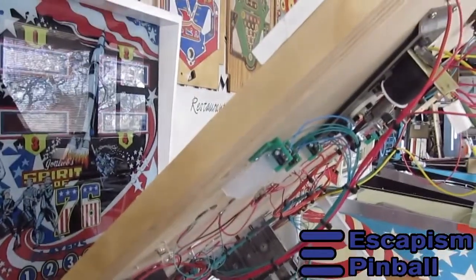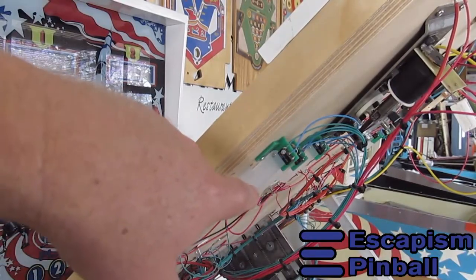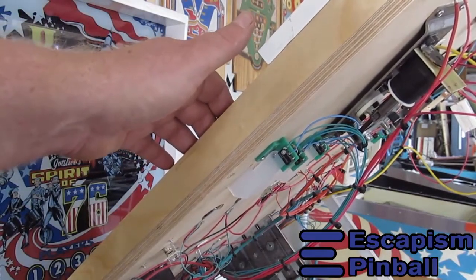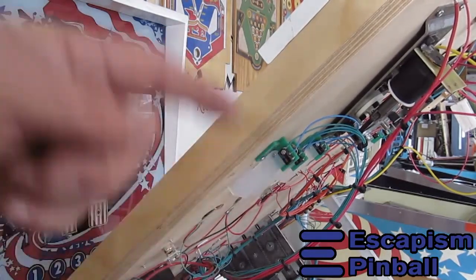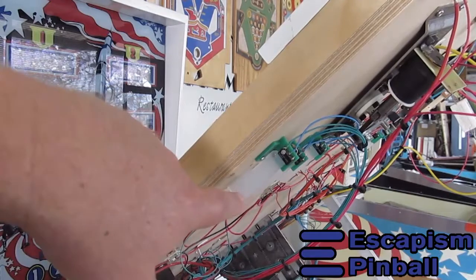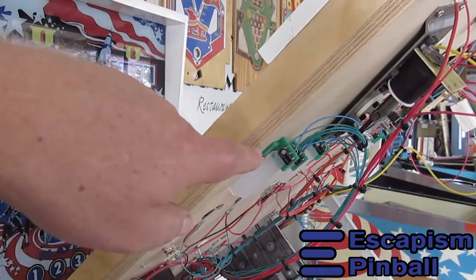These little switches I make myself. I'm lucky to have a laser cutter, so I can cut... what's it known as in the States? It's acrylic. In South Africa it's called perspex or plexiglass. These switches run off little tiny micro switches, so they don't get dirty, and they have a million switch lifetime. They don't wear out, they're easy to adjust, and they're very soft, so you can let the ball go pretty much just above the switch and it will roll over and still trip the switch.